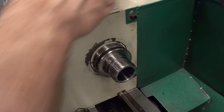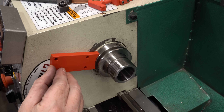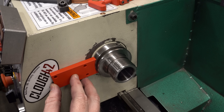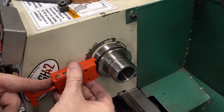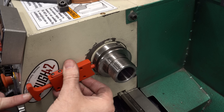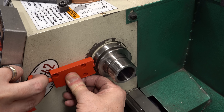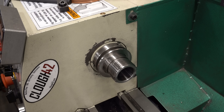That's why I measured in the first place, but it's always nice to see when it turns out to fit. The drilling guide fits very securely against the spindle nose — I should be able to line it up parallel to the top of the lathe, clamp it in place, and use it as a guide to drill the holes. However, looking at the prototype, the holes don't line up, which is a great thing to discover before drilling holes in the lathe. We've got to remember to move those holes and reprint the drilling guide, or we will have a bad day.